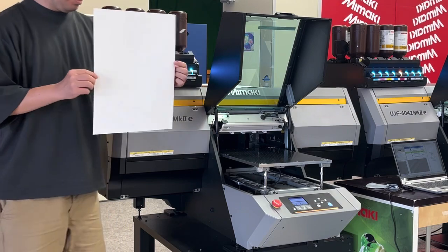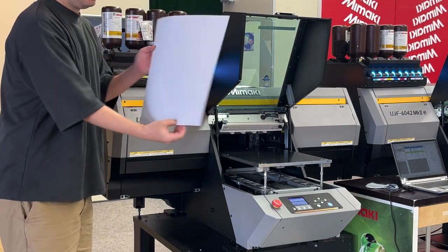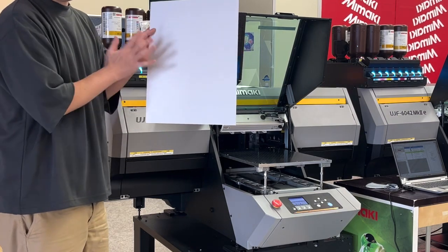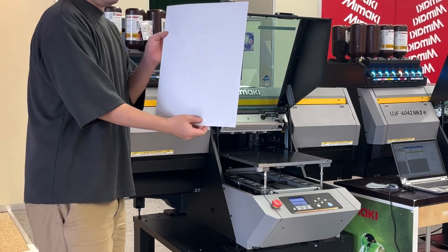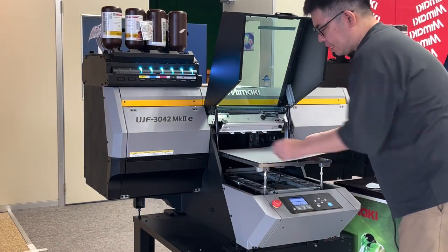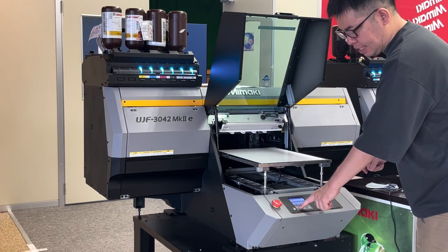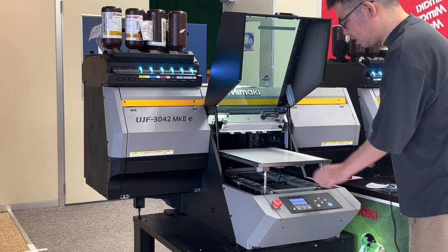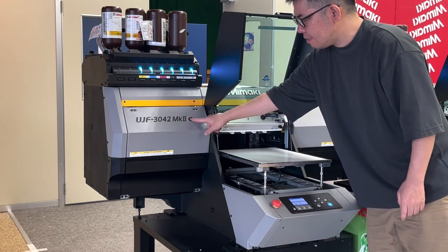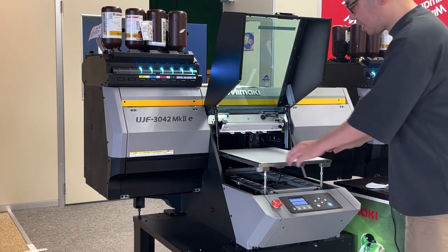To package the papercraft printing, we're going to print on the coated side — the 0.5 or 0.6 millimeters of the coated board. We put the paper on and turn the select button to switch the vacuum open. The vacuum table is optional with the 64-inch model, but as an upper model, the suction table comes included.